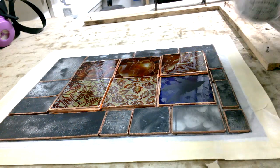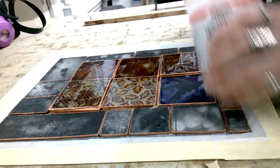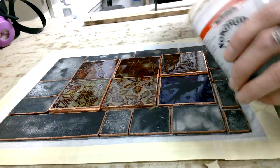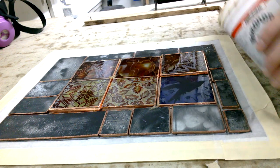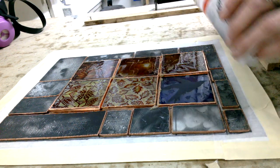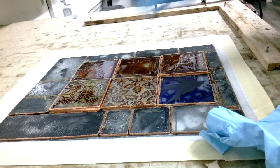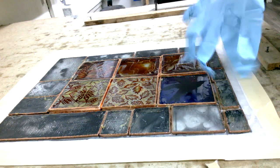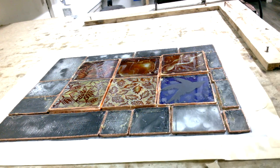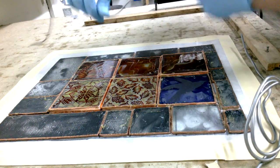And here it is — the moment you've all been waiting for — soldering itself. The first thing you want to do is put flux all over every copper surface you can find. Remember, flux is Latin for 'flow,' and your solder is not going to flow without flux. So you flux the whole thing. And now I'm putting on some neoprene gloves — it's not just for safety, it makes it a whole lot easier to clean your hands when you're done. After I have the gloves on, I'm going to get my spool of solder and unwind it so that I have a whole bunch of solder available.